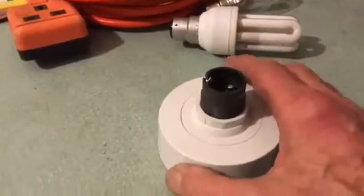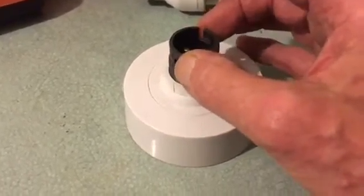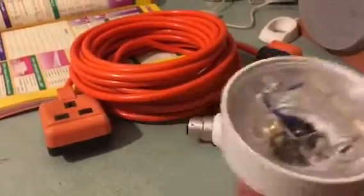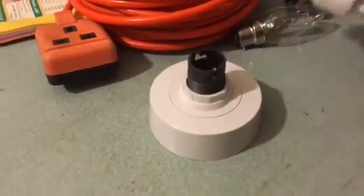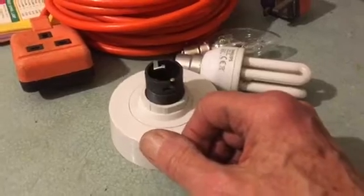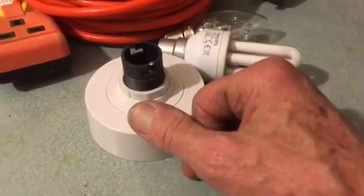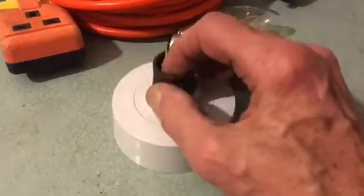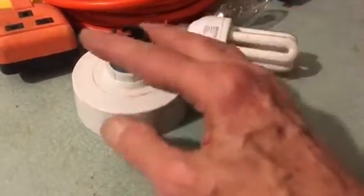When you've changed your light bulb and fitted it in, turn your switch on and it'll light up. If it doesn't, it could be one or two things: the fuse may have gone, or if you've pulled down on the pendant fitting you may have pulled the wire out. Also, with the old type bulb, the filament would sometimes break and part of it would drop across the electrodes inside, shorting it out and that will blow your MCB — your circuit breaker — because it draws too much current.